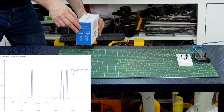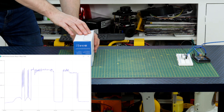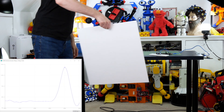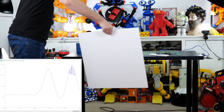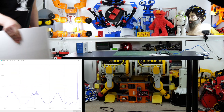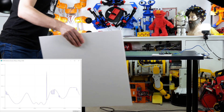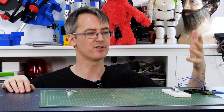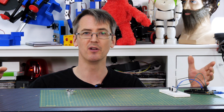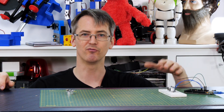You can see me moving to the side and there's a big spike where we just miss the edge of the object and get the wall behind me. If I want to detect something much further away I'm probably going to need a bigger object to make sure it's reliable, like this big board, so I can actually get up to the 4 metre maximum distance — I'm only doing about 2 metres here. There's some noise on the trace on the Arduino plotter which is basically just measuring the distance given by the unit, so there's not too much coding. We could use these ultrasonic sensors to position a robot or drone provided there were solid uninterrupted walls in the space so it could always get a reading.